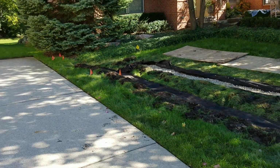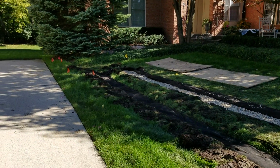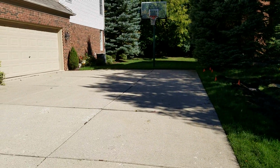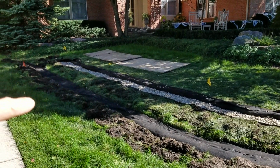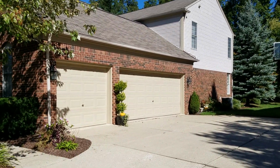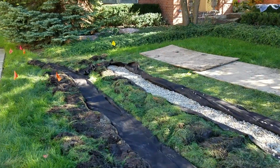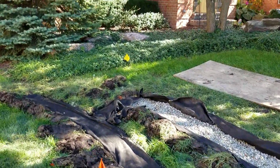Okay, we're installing a large drainage system, a Freedom Drain, French drain as they're known. We have the neighbor's driveway water running off into this collection area. We also have the roof water. You can see the downspouts, there's the gutter troughs. So we're picking up all that water. Concrete being non-permeable, we're not losing any water in these rain events. It's all collecting right here.